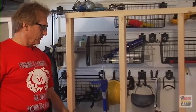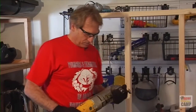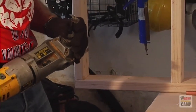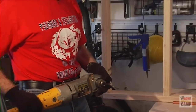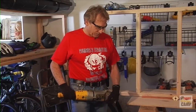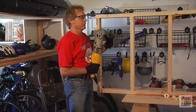Now that we've correctly and carefully laid out the holes to run the copper pipe through, we'll use our right angle drill — this one has a clutch on it. For this size bit I'm not going to use the clutch; I want to drill at a higher RPM. It has 300 RPM and it has 1200 — I'm going to use the 1200 RPM. Before you start, make sure your bit is sharp. Make sure your bits are in good shape, otherwise you will never get through the wood.